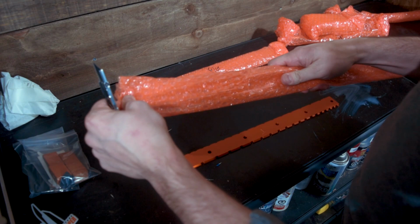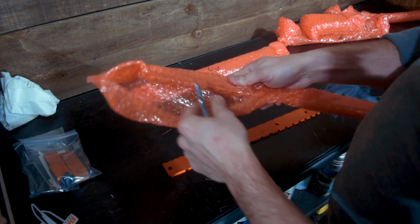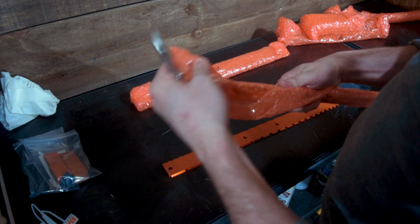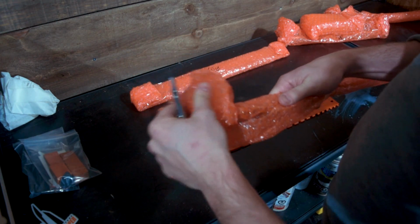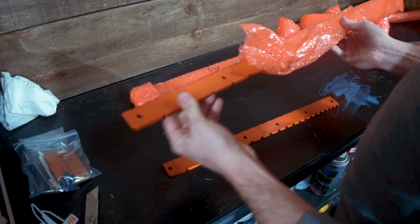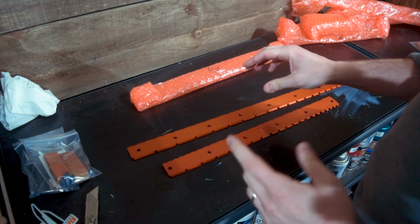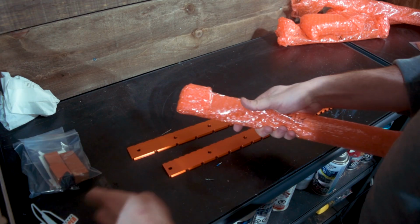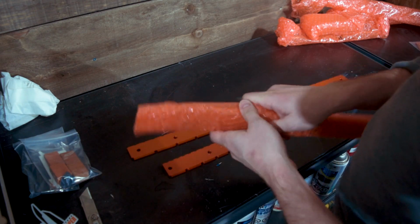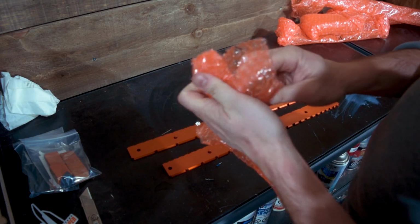In this particular instance, on these notched straight edges, again, we have the same issue where it's important that you make sure that you're dealing with something that's as close to perfectly flat as possible. That's the entire point. The edges have to be straight, right? And over time, the cheap ones can warp, they're thin, and they're a little bit harder to use. But if you get a good high quality one, which these obviously are, notwithstanding that they're just gorgeous, you don't have to worry about that sort of thing, and you know that you're gonna get a decent fret job at the end, or at least you're gonna have a good guide to go off.